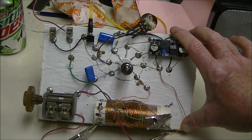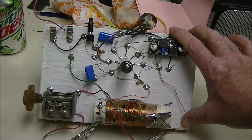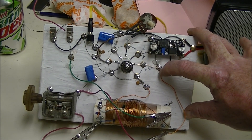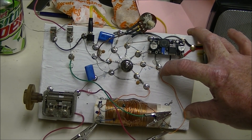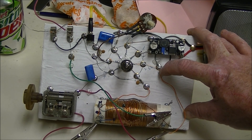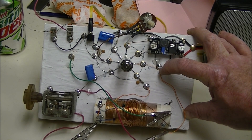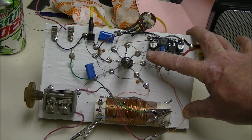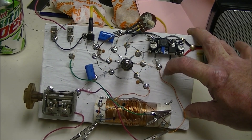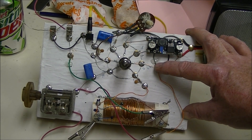One of the construction techniques I did — if you look real close, it's a wooden board that I simply glued a sheet of paper over so I could make notes and mark things. These are metal-head thumbtacks. They are very handy for solder tie points, something I've done for years. There is of course a tube socket — it's a nine-pin tube — but using these thumbtacks, which are really easy to solder to, makes it easy to lay out little test circuits.